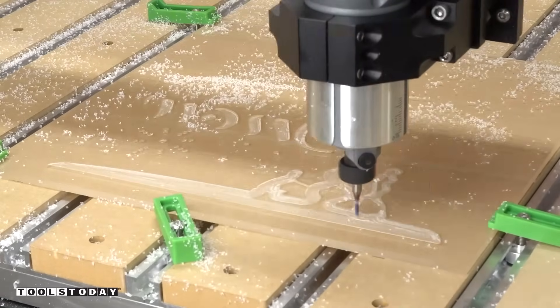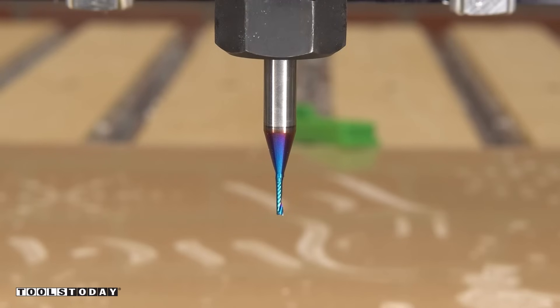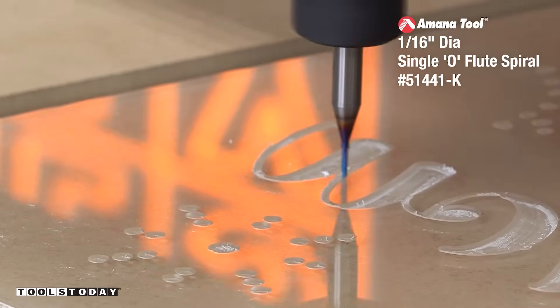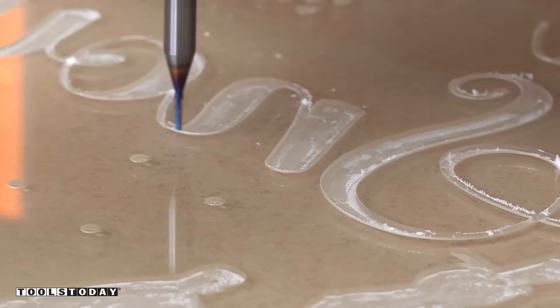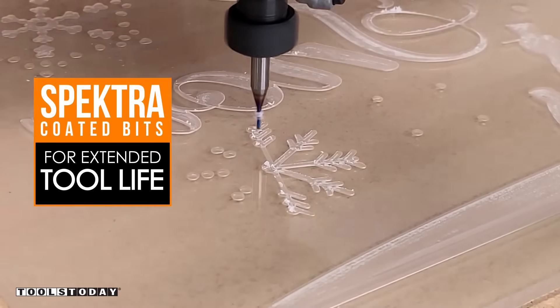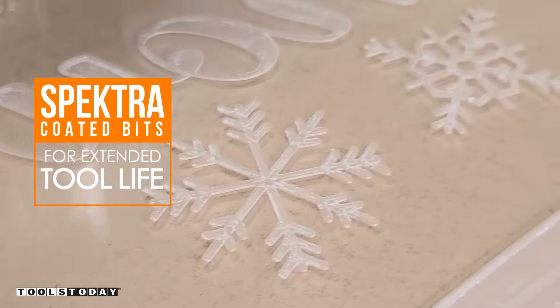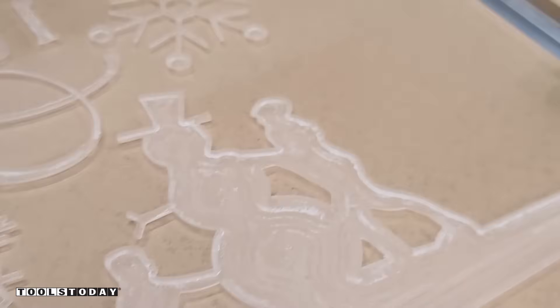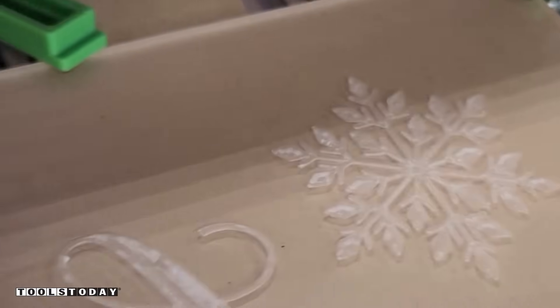This is a larger clearing bit. We're using the Shapeoko with the bit setter to use multiple tools. We got that switched out for the 51441-K, 1/16 inch spiral o-flute upcut bit to carve in all of those finer details. The larger bit went through and got all of the large details, and this is going to come through and pick up everything that that bit could not get. We got all of that done and it looks really nice — really happy with the way that that looks. The bit setter made it really easy to switch out bits for the project.